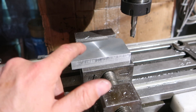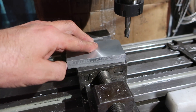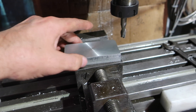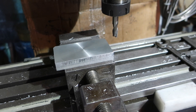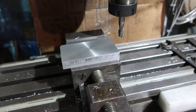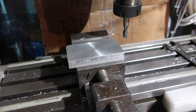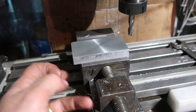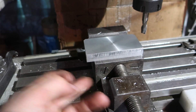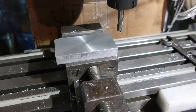What John's block basically does is make a sine bar without needing a sine bar or gauge blocks. What we use is some hardened pins in specific holes that are relative to one of the edges — or in fact to both of the edges — given that the block is more or less squared up. You can use that to rapidly set the cross slide or the angle on a lathe, or set the angle of a vise on the table. So that's what we're going to do.